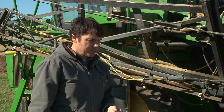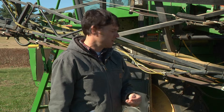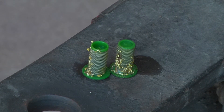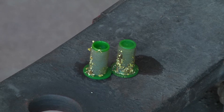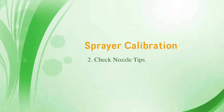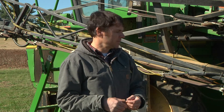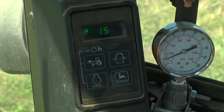Before starting sprayer calibration, the very first thing you need to do is properly clean your sprayer. Remove all the nozzle bodies, nozzle tips, and nozzle screens. If you see screens that are excessively filled with trash, throw them away and put new screens in. When you take the nozzle tips and screens out, inspect them for trash, damage, and uniformity. There are 50 mesh and 100 mesh screens, so make sure you have the proper screen for the proper nozzle tip. Also check that you have the same type of nozzle tip throughout the entire boom. Once the sprayer is cleaned, fill it with water, put the nozzle screens and bodies back on, and bring the RPMs up to your spraying pressure.